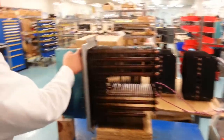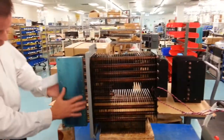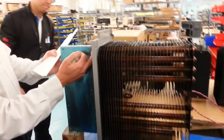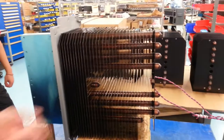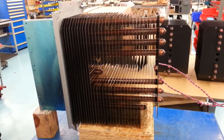And here's those heat pipes we talked about — see the copper rods, oil filled. This is where the IGBTs are mounted. So the heat dissipates through the aluminum block, into the copper oil-filled rods, through the heat sink. And these are mounted closer to the outsides of the rail car — natural convection. Air blows right through them. So there's no fan — natural convection.